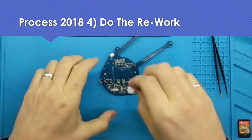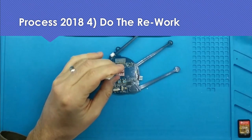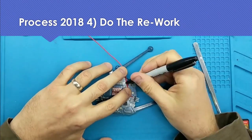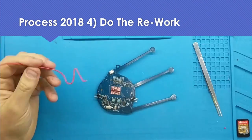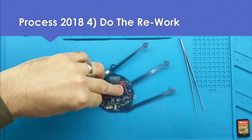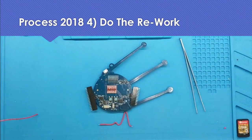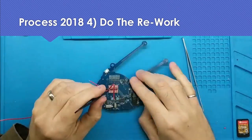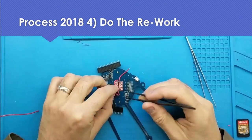We're going to attach the level translator to the center of the badge with super glue and let it set. Next we're connecting that power rail using a snake — taking hookup wire and removing insulation from the middle in the right locations. I mark it with a marker, make two cuts, and twist to remove the insulation. Once it's in the right shape, I add protective elements onto those pin headers so the pins stay aligned when I solder. Adding tacky flux, putting it in the right place, adding heat and solder. For large connections you might need to hold the iron for quite a while, but connecting to an SMD capacitor won't take nearly as much heat.